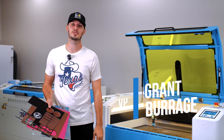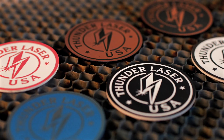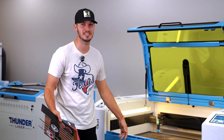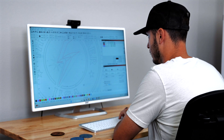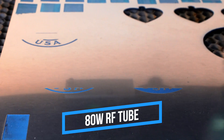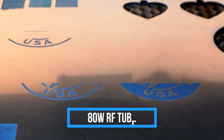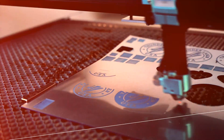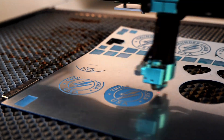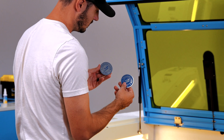What's up everybody, this is Grant from Thunder Laser USA. I'm just trying to show you guys what our new Titan series machines can do on dual layer acrylic. For this video I'm using the Titan Pro 35 with an 80 watt RF tube. I'm running it at 2,000 millimeters a second with 35% power. Doing two patches at one time it took me two minutes and 50 seconds, so doing just one patch will take roughly about a minute and a half.